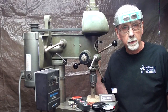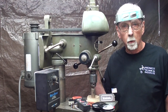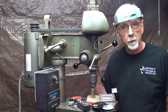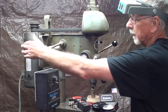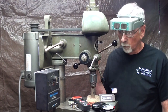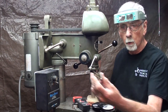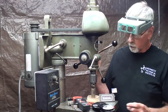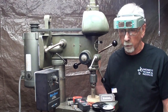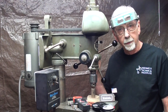Howdy once again, it's Tubal Cain and I'm standing here before my Walker-Turner drill press and this is tips 481. Be sure and watch the several tips before this particular one and the following ones. I've been doing a series on DC motors and controllers, and I've already got it up and running in the last videos. In this one I'm going to experiment, take meter readings, install a reversing switch, and do some very unscientific torque testing to see how much power we have at a very slow speed with this DC motor.